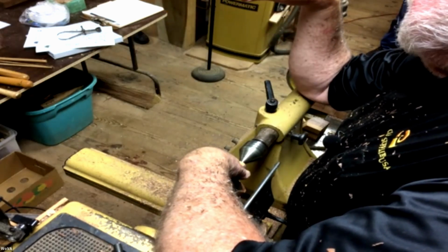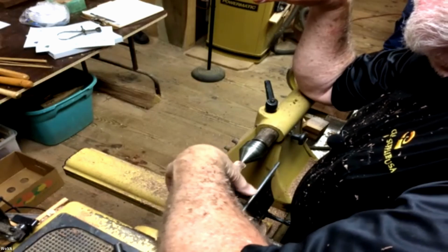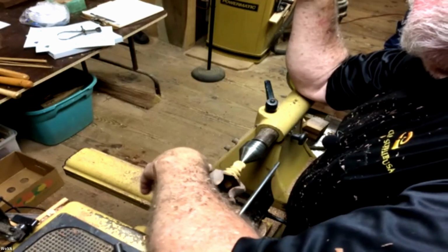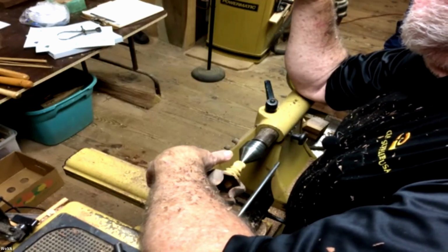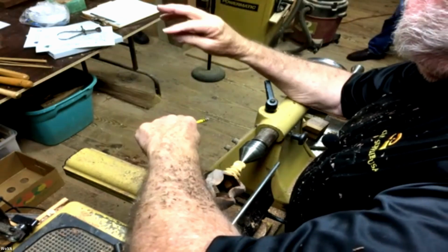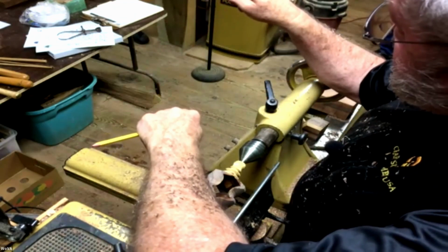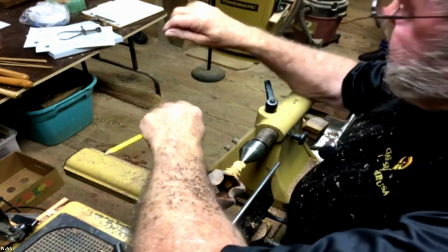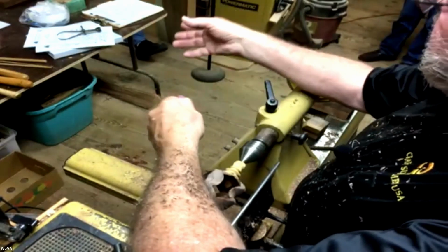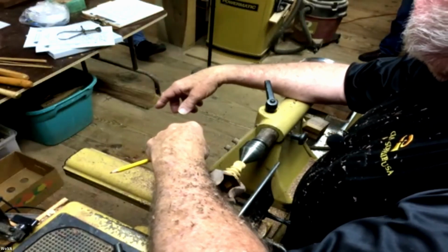I make my own display racks. When I go to a show, everything on the table is made by me. Display racks, the ornaments. One thing I didn't make was the bronze brazing rods. That's what I use there. And you get that twist on without a kink. I take a piece of PVC pipe and drill a hole through it someplace the same diameter as that rod. Then I put a kink in it and wrap it. And I don't get any kinks in my rod. Same thing to make the bending jig. Well, I just use PVC pipe, but that's not hard to bend.